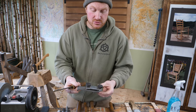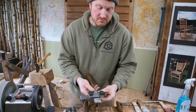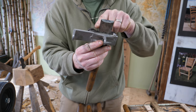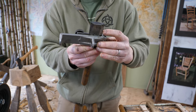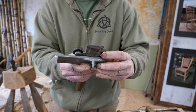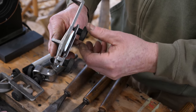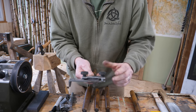We're going to use the same universal jig that we used for grinding the skew chisel, and we're going to place the chisel into the jig leaving about two inches sticking out. It's important that we line it up so that we try and keep these edges square — 90 degrees to the face of the jig. You could use a little engineer's square, but I tend to place it in the middle and visually line it up. When we tighten these screws up, it's really important that we tighten them equally — we don't want this to twist in the jig, so we want these two parts to be parallel and apply equal pressure on the chisel.